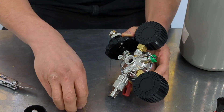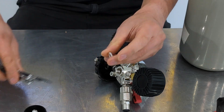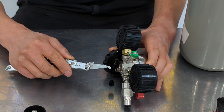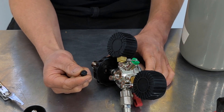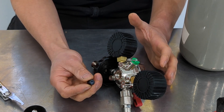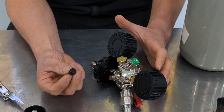You use that knob from the front of the regulator to undo this bung at the back — you can see there's an 8mm hole there — and take the back of the regulator out. Really easy, no tools required, doable in the field with nothing at all. A spring is going to fall out like that. If you've got small fingers you can probably just pick the parts out; it's a little easier if you have something sharp like a toothpick. Then there's the seal for the bung, and last but not least the seat cap assembly — this is made out of ultra-high molecular weight polyethylene.